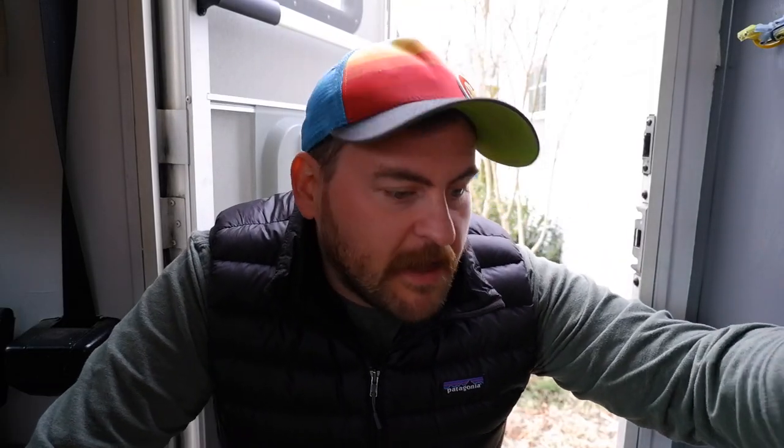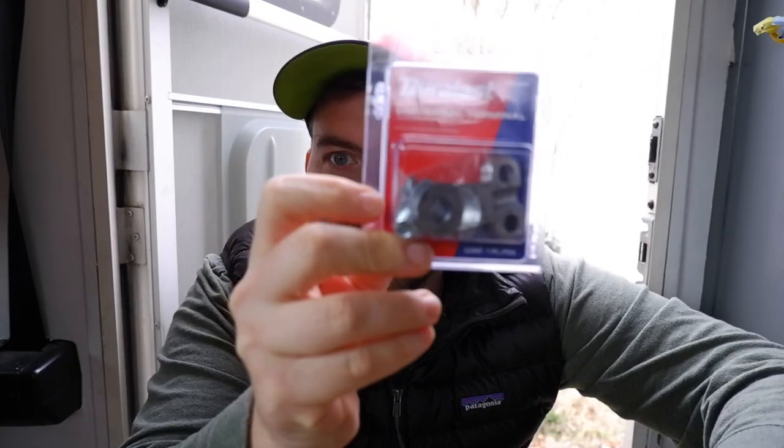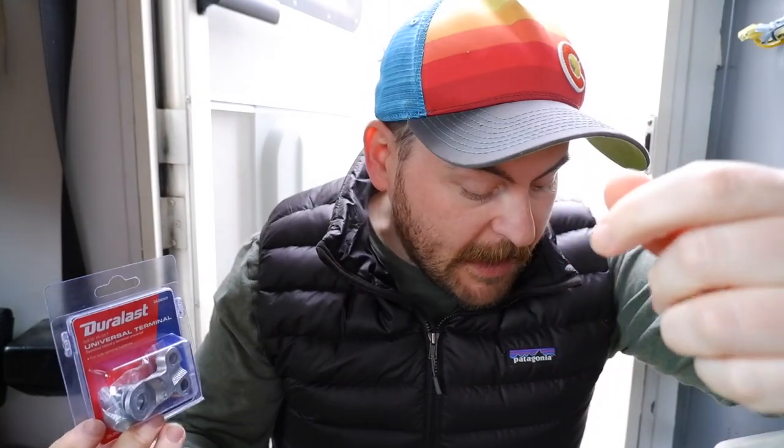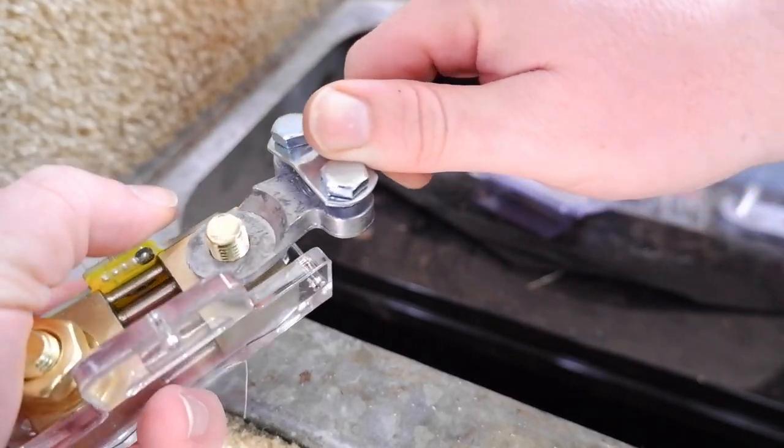I didn't have zero gauge in my kit of battery cable terminations, so I went to the auto parts store and found a universal side post terminal. I wasn't super stoked about how small the connector was — with battery connections, a weak connection means heat, and if it's not connected well it'll get hot, which is dangerous. So I got it all hooked up, put load on it, ran the furnace and some fans, and checked for heat. The new terminal ended up fitting great and never produced any heat under load — a relief.